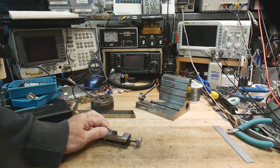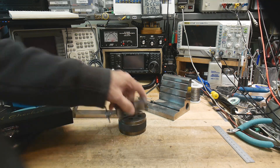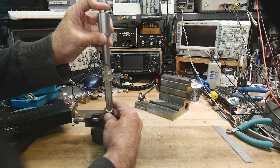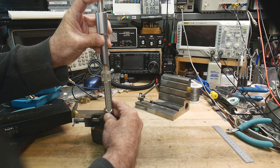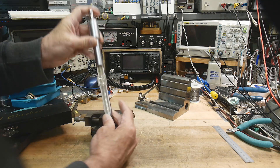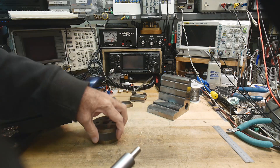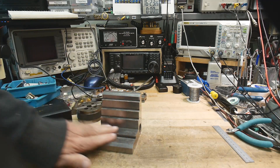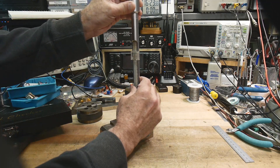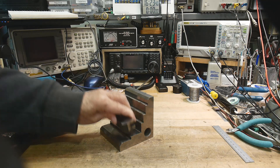This is a little Brown and Sharp machinist vise. Let's make sure we have enough mass on this thing and bounce it off the hardened jaw here — this is supposed to be hardened. It's going up to about Rockwell 61. And let's try this right angle block, which should also be hardened. It's about the same — so these two are both about Rockwell 61.